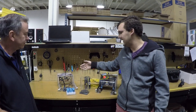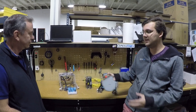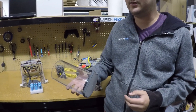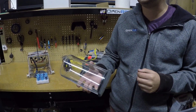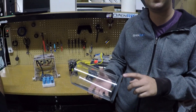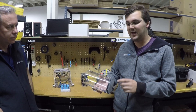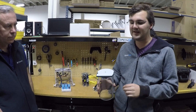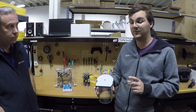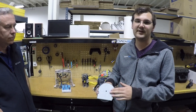The first thing we had to modify was the battery tubes as well as the main housing. The acrylic end caps on the stock 2.8 can't handle the pressures at the depths we were operating. The main 3/16-inch acrylic tube can handle the depth, but the end caps we had to rethink. It's the same stack-up as a normal 2.8 end cap but machined out of a solid piece of Type 2 PVC. We also recessed the outer white 1.5mm acrylic and switched from a syringe to an o-ring screw for the venting mechanism.